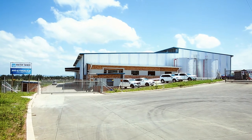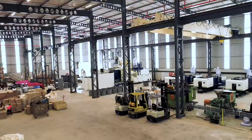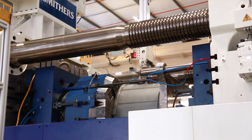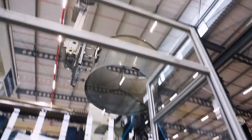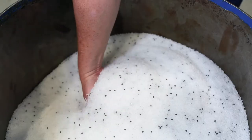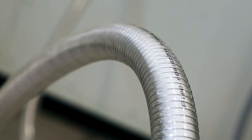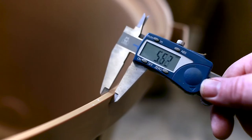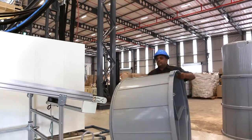WaterTainer's state-of-the-art construction begins at our custom-built facility in KwaZulu-Natal, South Africa. While other water storage solutions are created through a slower rotor molding method, our Tough Tanks are injection molded, offering a superior homogenous plastic melt using pressure and heat. They're made from polypropylene, the same extremely strong plastic used to make car bumpers. This strong material, combined with a consistent injection molded wall thickness, creates a tank that's stronger than any you've seen before.